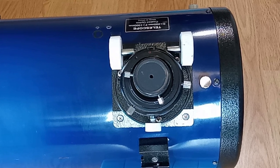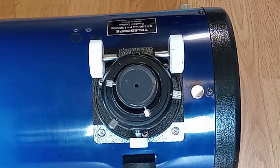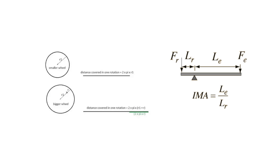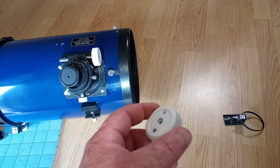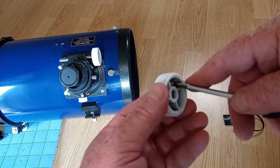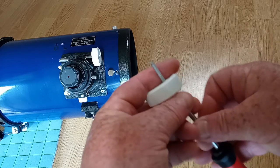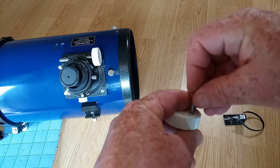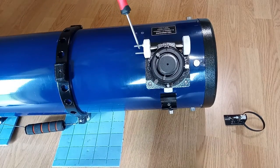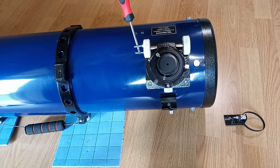Until then I was looking for some other option, and I'd seen in other sources that you can simply just put a bigger wheel on there. With a bigger focuser wheel — a larger diameter on the outside — due to physics, you can achieve finer focus control. But I didn't have the space to put much of a larger wheel on there. So what I did instead was took my wheel, drilled two little holes in it, and put two bolts up through those holes with nuts to hold them in place. When reattached, you could simply use a pen, a pencil, or a screwdriver, and you get the same effect as a huge wheel.